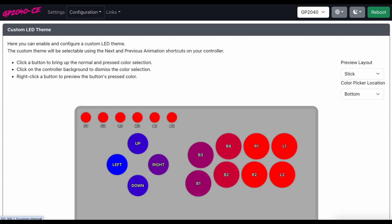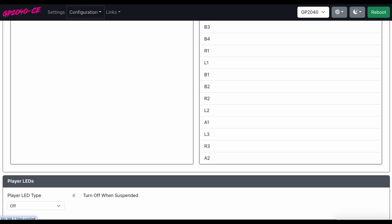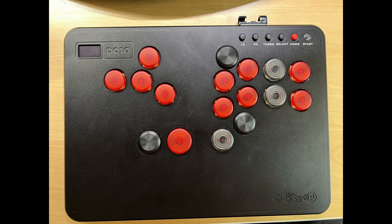Go back into web config, set it up the way you like it, and you'll be off to the races. I'll share screenshots of all three of my controller settings. I'll also show you how to turn on the pass-through port, and you will need to set the turbo pin to negative one. That way you can use pin number 15, which is one of the buttons on the front of certain controllers.